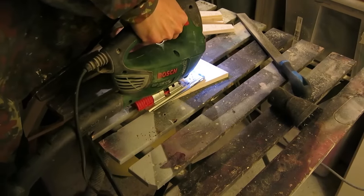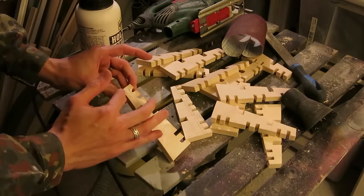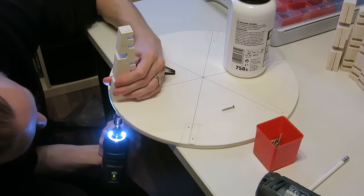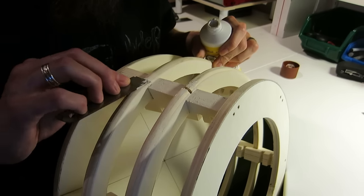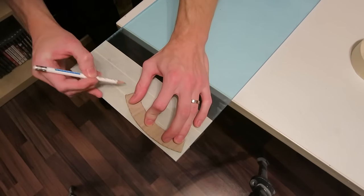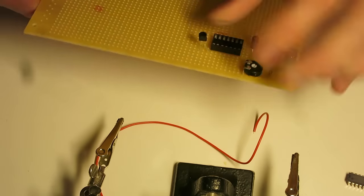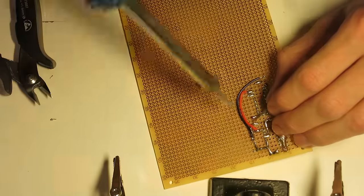On top I want to insert acrylic rings illuminated by an LED fading effect. I created a basic construction from wood, covered with filler to get rid of the typical wooden structure. Then I cut the individual pieces of the illuminated rings from acrylic glass. For the running light effect I used a microcontroller that I soldered on a circuit board.